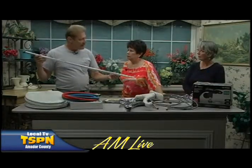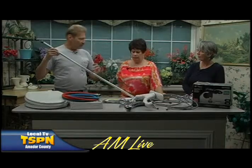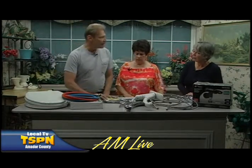Now, a lot of times, water softening companies and other people will tell you, remove that anode rod and the smell will go away. And in many cases, that is correct. However, that voids your warranty. Water heaters have a 6-year warranty, 1 year parts and labor, 5 years on parts. And if you remove the anode rod, you have just voided your warranty. This slowly deteriorates, and so it's called a sacrificial anode rod. So that's one way to get rid of bad smells in the hot water.